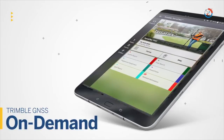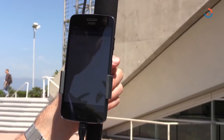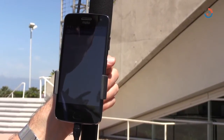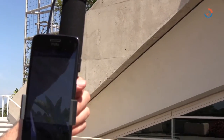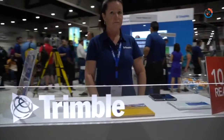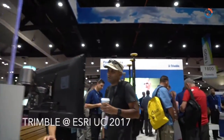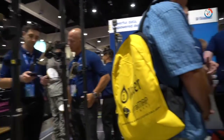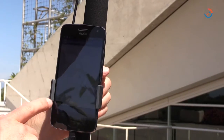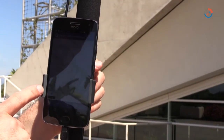We'll go into our map, and when the map loads you'll see that the Catalyst receiver has connected and is starting to generate positions. Here we are in the map view — you can see we're positioned with a nice little blue dot just outside the exhibition hall, and we're getting an estimated accuracy of 2cm on the receiver. We can log right into the map and see where we're standing, and you can see just how accurate the position is — we're not moving around on the map at all at this point.